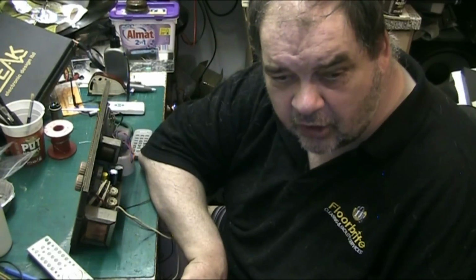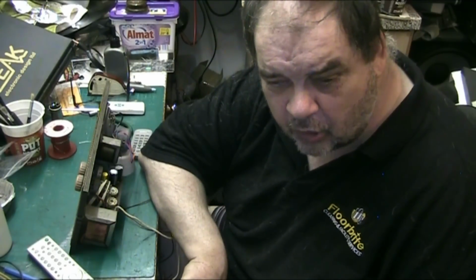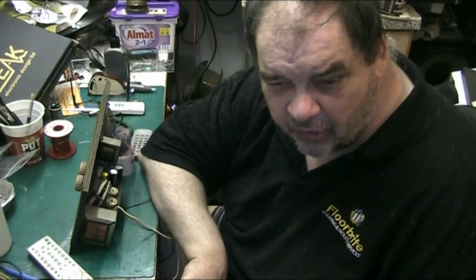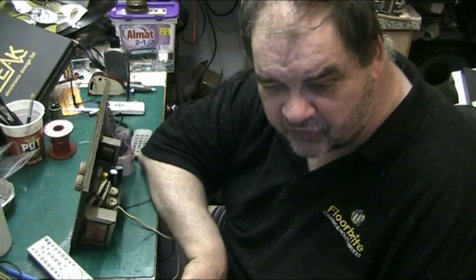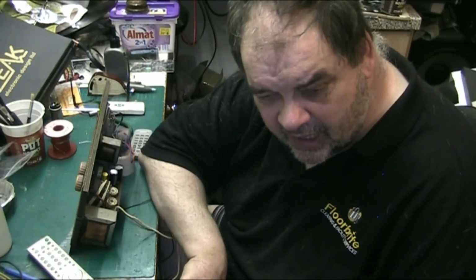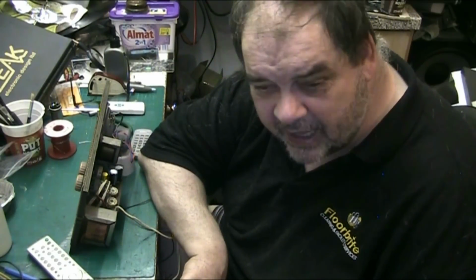If you're doing a lot of radios, and yeah, a signal generator, signal tracer, it takes a lot of the legwork out. Them little peak testers, they take a lot of the legwork out, and they give you a better than good idea of the state of a capacitor or resistor. You know, really good, and I will always buy stuff like that because them peak tools are made in Britain.